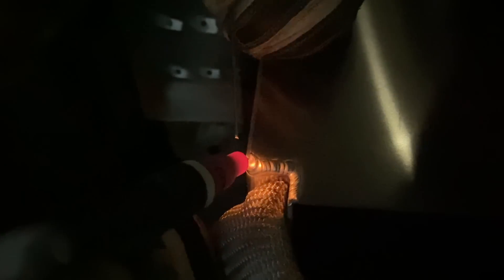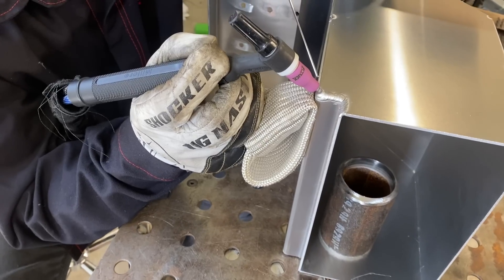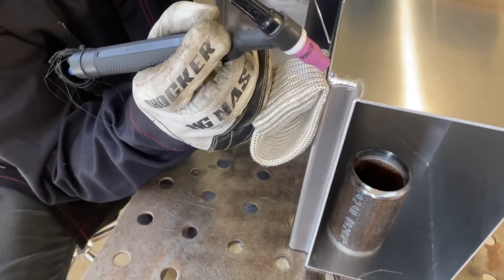Once Brad has enough tacks on it, any areas with slight gaps get welded first so they won't open up anymore while he's welding out the longer seams. This is a pretty good example of where pulsing with the foot pedal comes in handy - you're making a 90 degree turn. You can pause for a minute as you change the torch angle and pulse when you want to, hang out there long enough to turn the torch, then hit the high amperage part of the pulse and keep going. It makes it all look the same.